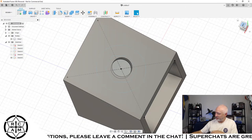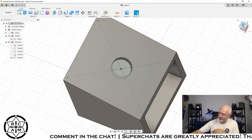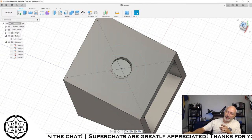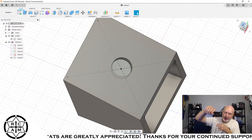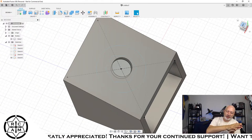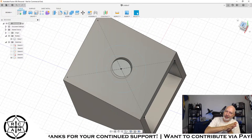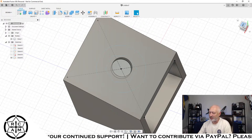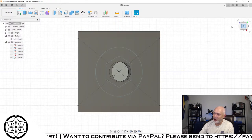And then we can put our lock ring and our nut on there to tighten it up. And because it's got that relieved area underneath it, we can tighten that up and it will hold it in place. We don't have to have a tool on the bottom side there. So that was another thing that I was trying to consider, is being able to hold it in place while I tighten it from the top.